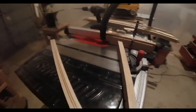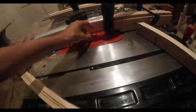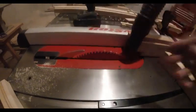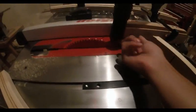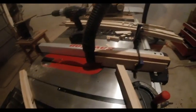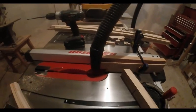In order to not have the pieces that I cut off the boards get stuck between the blade and the fence, I'm using a stop block that doesn't reach all the way to the blade so there's more room. And second, I have a hose coming down — because the pieces are too large to suck up, it will blow the pieces out so I can collect them afterwards. I've done a couple of tests and the pieces do not come in contact with the blade after they've been cut.